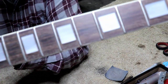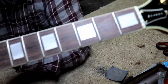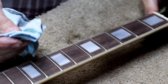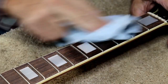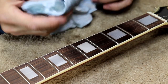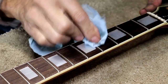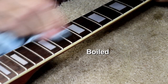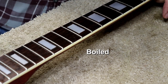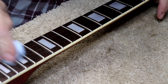Well, that looks real nice now. The ugly duckling thing has gone away. It's still not as pretty as it will be after we oil it, but it looks pretty nice. Hopefully you can see what it does when you oil it, and just makes it look so much better. And then they even look better, in my opinion, once they're actually dry. But anyway, we're just going to oil the whole thing now. And yes, I know there's all kinds of oils out there. I use linseed oil. It's what I've been using for all these years, and it works good. I see no point in changing.